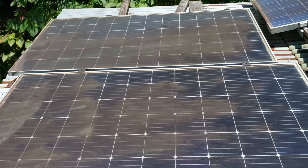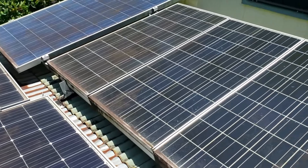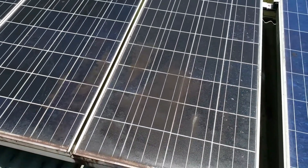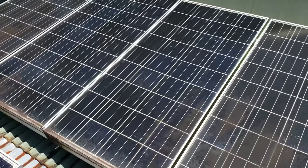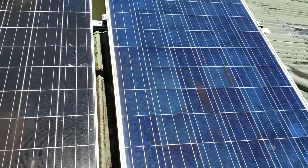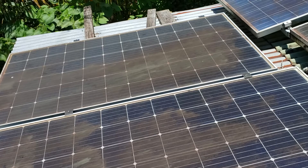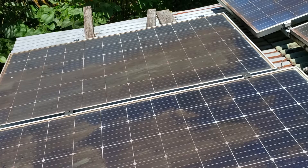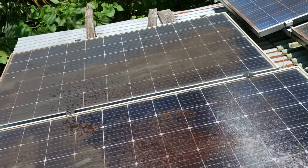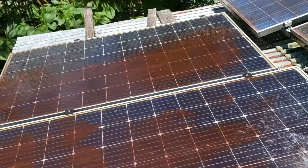We're up on the roof and here are my solar panels. You can see they are a little dirty — there's some dirt here, especially along the bottoms that builds up, and any little bit of dirt really hampers the efficiency. Make sure before you begin that you turn the whole system off before you start washing your panels. You don't want anything to cause your panels to malfunction. Then I like to start off with the hose — get them a little wet, spray them down, see what I'm dealing with, and soften that dirt up a little bit.